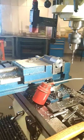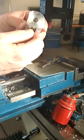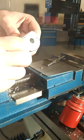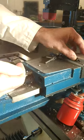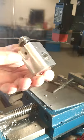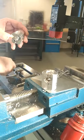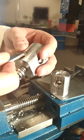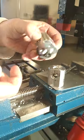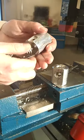You're going to repeat the process on the opposite side, following the steps, just ensuring that when you turn it around, you cut the slot on the correct side, but you're repeating the exact same steps that we just followed there. And that, in turn, will have it looking like this. You've got both sides on the correct side, the depth is 4, and it's threaded and tapped. Then in the next video, we're going to make the brackets to fit this. When they're done nicely, it does a perfect snug fit inside, with a nice, neat radius to match. And that's the next video.